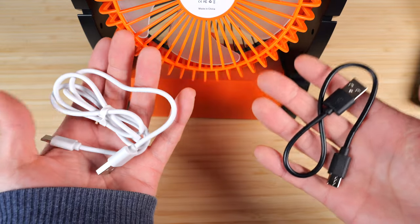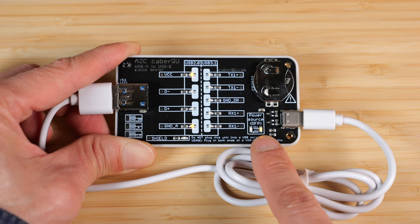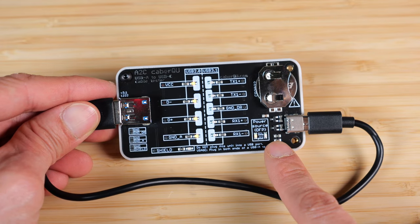What's the difference between the two cables? The supplied cable only has VCC and ground wires, plus a USB-C indicator. But the other cable has VCC, ground, D-plus, and D-minus, and also has the USB-C indicator — which is why it charges faster.